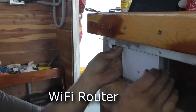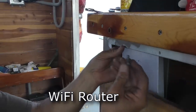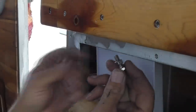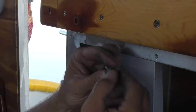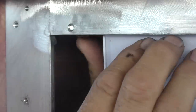Starlink has put some brackets on there to mount this thing with, but I've got a trick to show you. If you tap a hole and you want this bolt to come right to the end so you catch all the threads, put a nut on the bolt and then you can drive it in and tighten that nut down so it takes up the tension. It's just like a little piece of all-thread, but the nut. That way I catch all the threads but I don't have my bolt protruding so I can put the board back on.